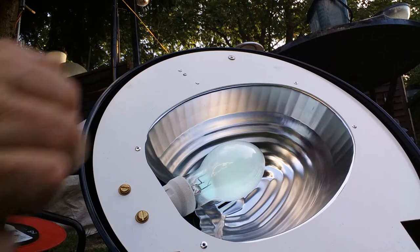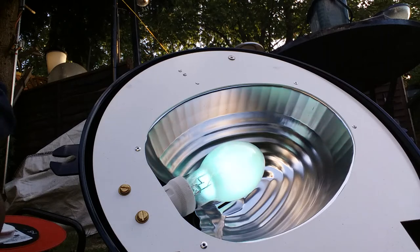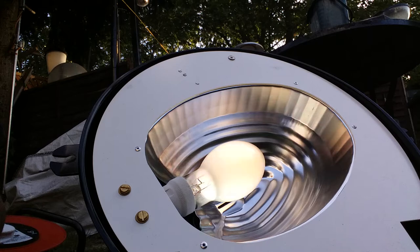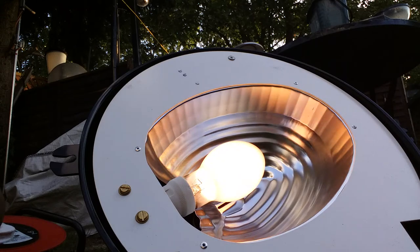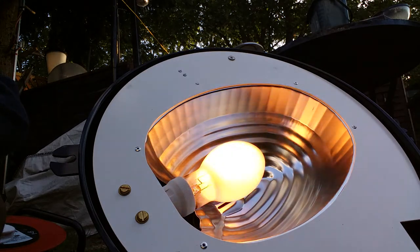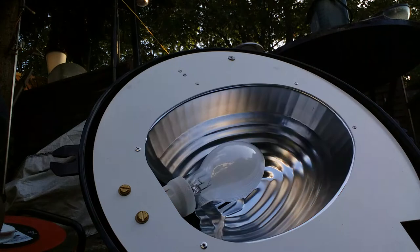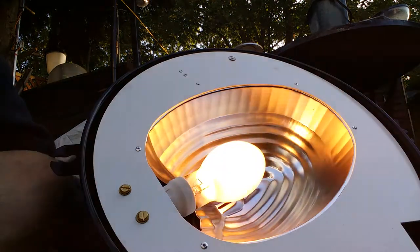Because we are outside we can't really see a lot, but it is actually starting to fire. It seems to be coping with it okay — it's firing up, looking like a mercury actually. Then yes, the sodium is coming through — the classic orange before the bright pink. My word, that is very orange! And there — the photocell switched it off, which sometimes happens when you do things in daylight.